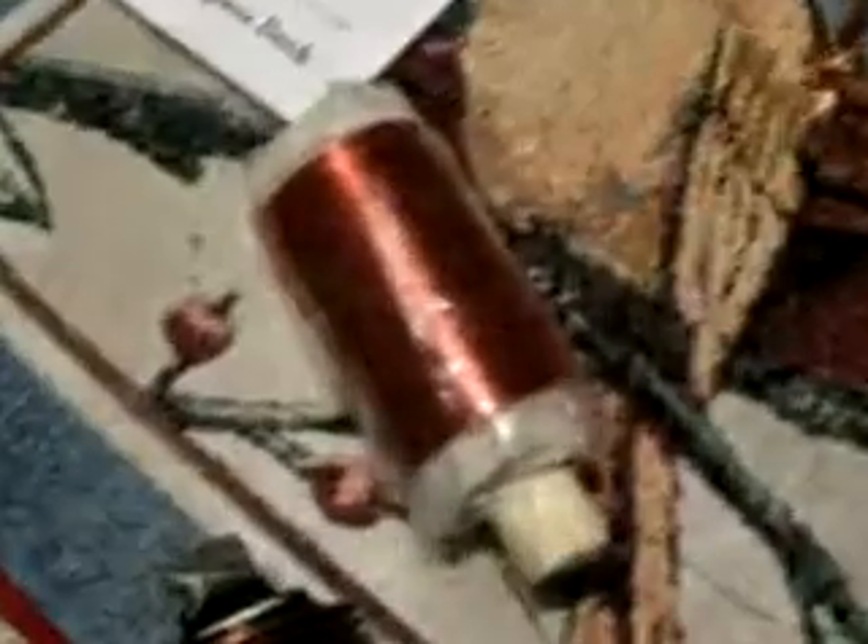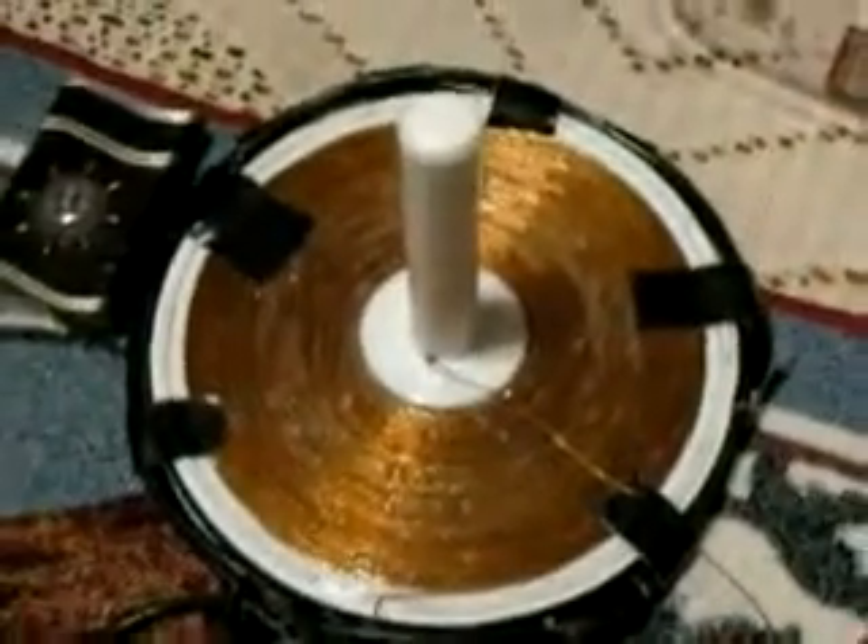This is my spiral Tesla coil. We got two transformers hooked back to back — a wall mount transformer to the secondary of this transformer, and the primary is hooked up to the circuit here. I got a little low-tension coil here, 200 turns wound on this one — I don't know the gauge. I got about 700 turns on that smaller gauge, and this is my Tesla coil.